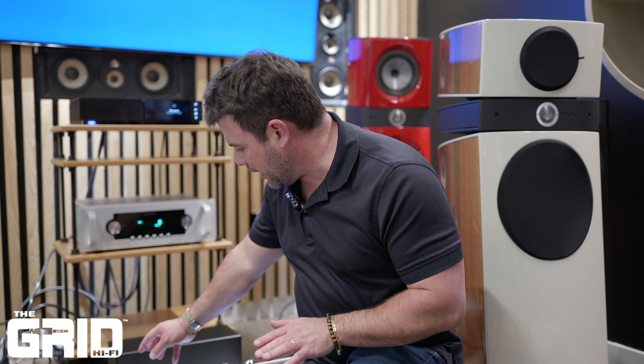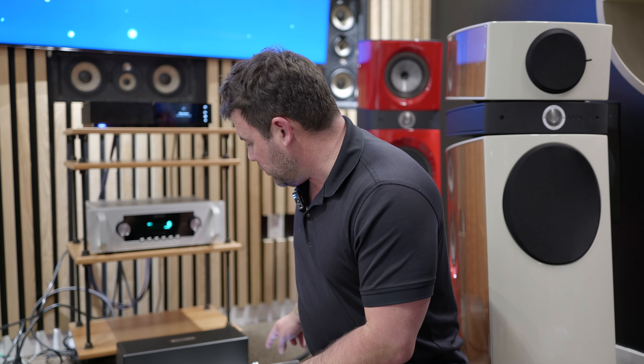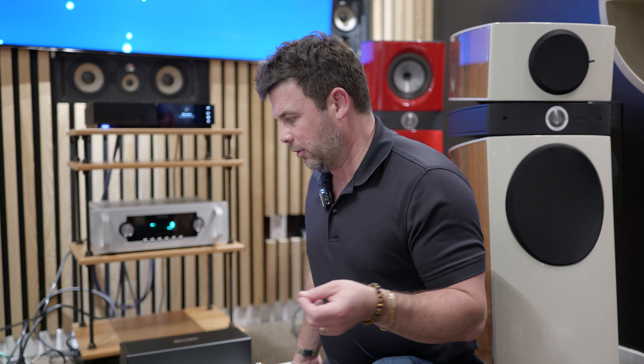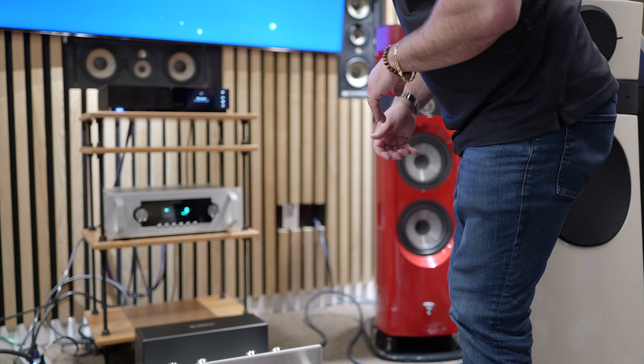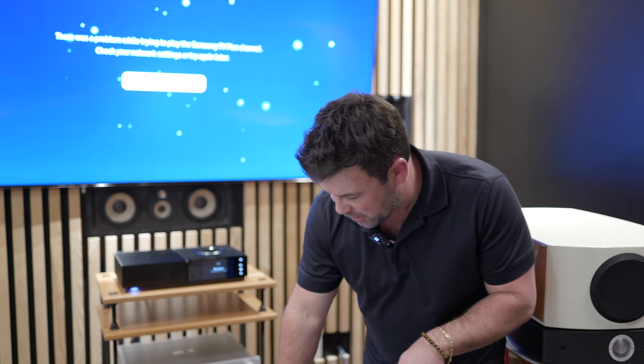All of the tubes that come into our facility are hand-tested and hand-matched, meaning that even though the manufacturer's specs have been met, we pre-classify again to more stringent standards all these vacuum tubes for particular electrical behavior. So the tubes that go into a REF-80S are pre-matched, and the tubes that go into an LS-28 are also matched. If you need a replacement tube, simply pull the tube out, give us the number on the side, and we will send you the exact tube for the piece of electronics that you are using. That's because the amplifiers auto-bias themselves, and we want tubes that have predictable behavior.